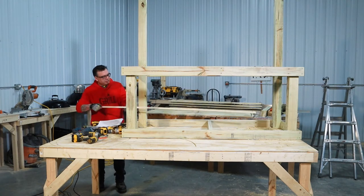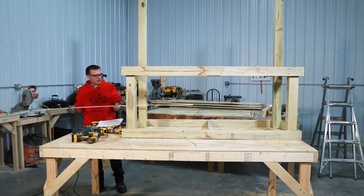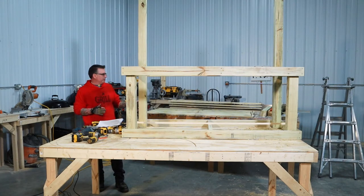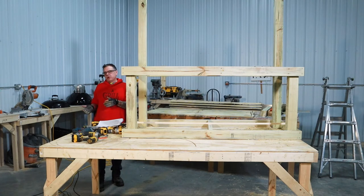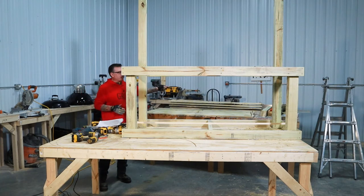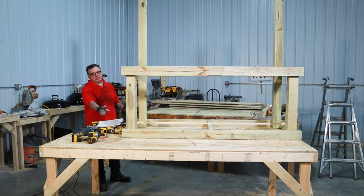And also on this, I created a spacer, quarter inch spacer. In theory, that's what should be between the boards. I thought they were 3.5 inch because they're 1x4, but some are 3¾, some are 3.5, some are 3 5/8. So I laid them all out, measured the total distance, measured the distance that we need here, divided that by 7, came up with 1/4 inch. Took about 4 times to figure it out, but we'll see if it works.